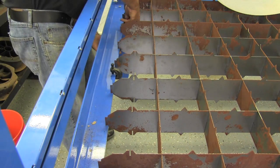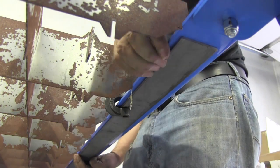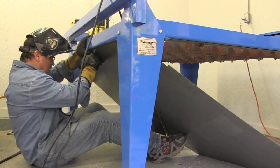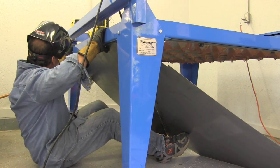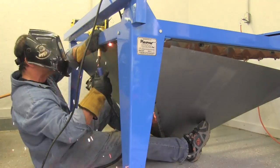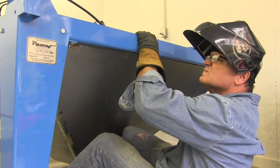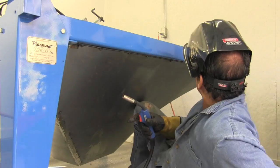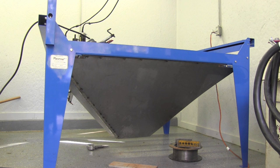So I'm going to clamp some flat bar to the bottom of the Plasma Cam here and then tack weld to that. This is how that looks from underneath — these are just some beam clamps. I'm going to clamp this underneath and then fish the piece underneath, hold it up, and get a few tack welds on it and see how it looks. If I have to cut the tack welds loose, it won't be any big deal — I can just get that cutting wheel on the grinder and slice through them. This is how working by yourself is: use your feet, use your knees, use whatever you've got to use. I'm using an old spool of Inconel 625 wire as a spacer and my knee for a little added force. So far so good — I think it's going to work.